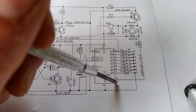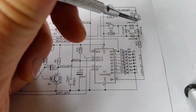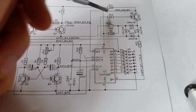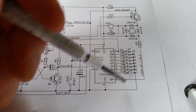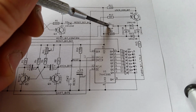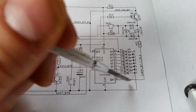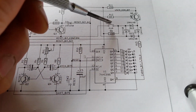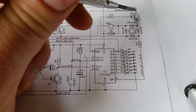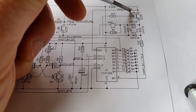But if there is an LED here, so 1 and a 1, which exclusive OR is 0, so that gets inverted to a 1, and the LED gets wrapped around and continues to rotate around the shift register. So now if someone's pressing the button, so this point is now 0 here, so no LED coming around, which is 0, and 0 here, exclusive OR is a 0, so then the inverter makes the LED lit. So whereas it wasn't lit, now it is lit.